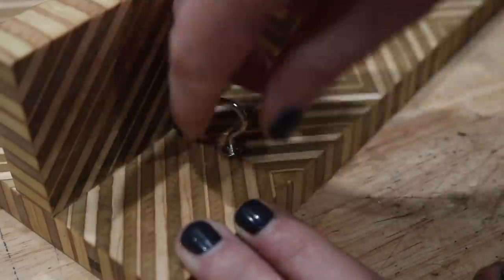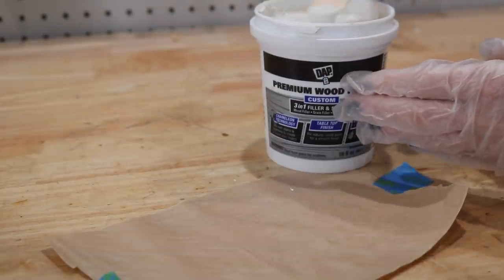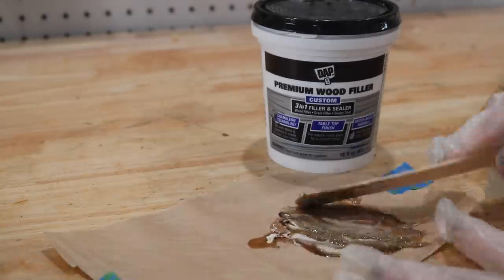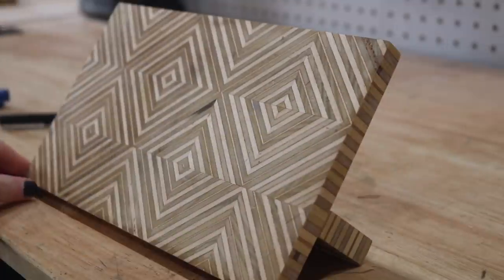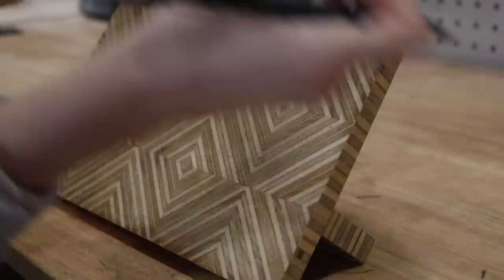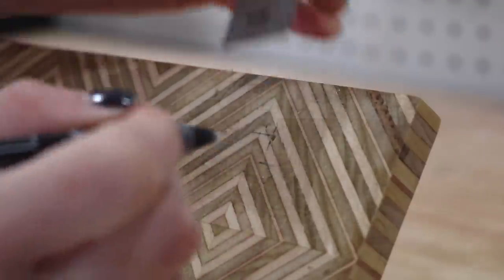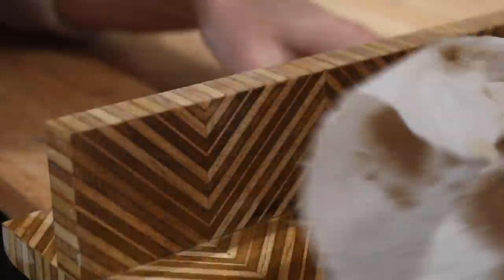I then reapplied the hooks and wanted to be done, but then I noticed that at some point in this process I had taken a super chunk out of the shelf. You probably can't actually notice it unless I point it out, but it was bothering me a lot. In the past I had used this premium wood filler that's tintable so that you can tint it to match whatever you're working with, and I decided to try it because I knew that regular wood putty would be too light. I tinted the filler using two different brown tones and then applied it to the chunk that was missing and allowed it to dry. As it dried, I moved on to attaching the d-ring hooks to the back of the key holder. I measured and marked where I wanted the holders to go and made sure they were symmetrical on both sides, pre-drilled the holes for the d-ring holders, realized I drilled the holes in the wrong spot, redid it, and then attached the holders in the right spot. Once the wood filler was completely dry, I hand sanded it flat and it blended super beautifully, then gave the piece one final coat of Danish oil to make sure it looked pristine.